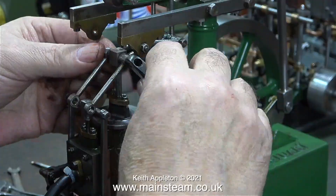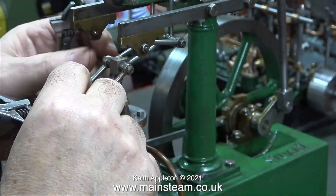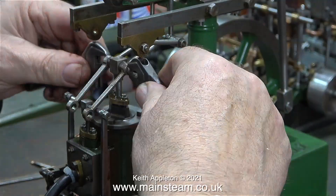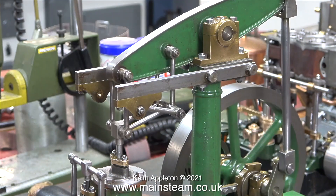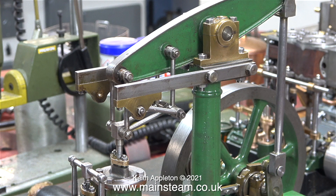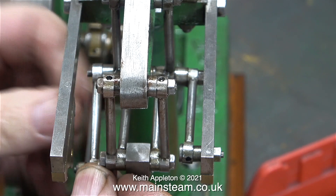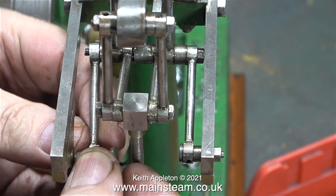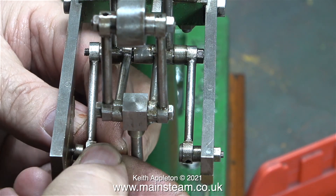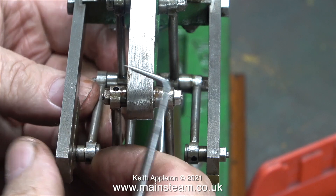Nothing is blowing past the piston to the exhaust pipe. As reassembly is exactly the same as disassembly in reverse, I'm doing this at high speed, and in no time at all — except for one link — the Watt's parallel motion is reassembled. Before fitting the last link in place I thought it would be a good idea to oil the engine, and as it turned out fitting this last link was the most difficult part of the job, but after a while it slid into position and I could bolt it in place.